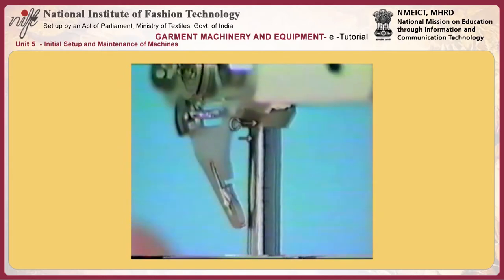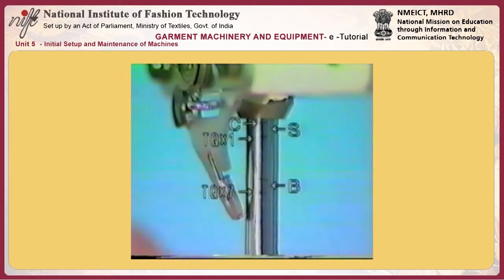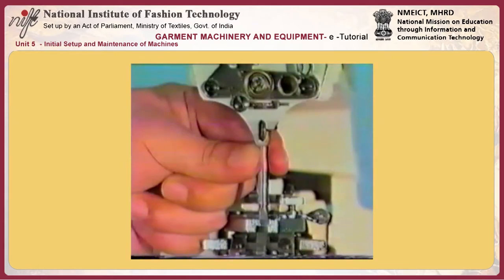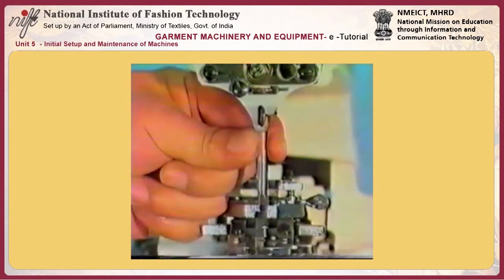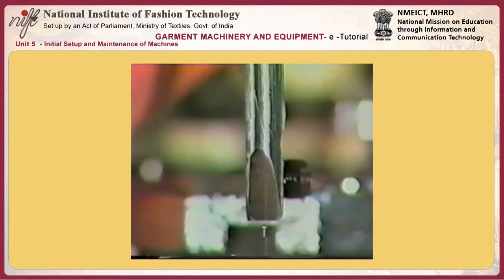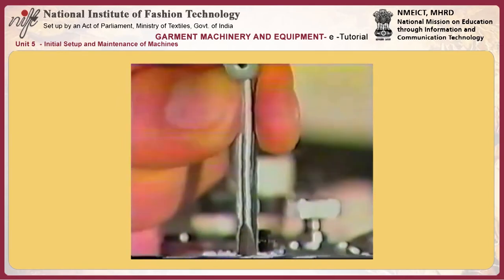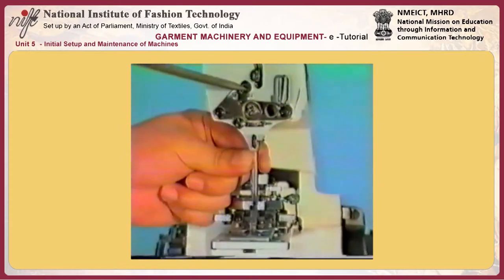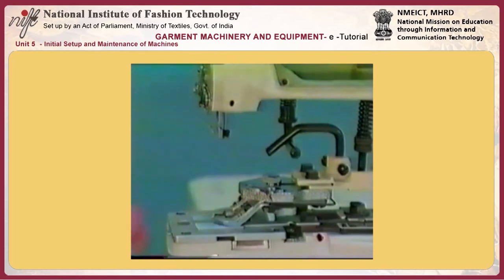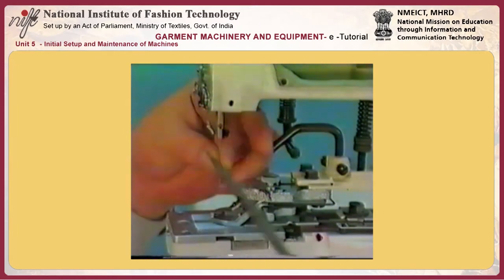When using a TQ by 1 needle, align the upper marker line of marker lines S on the needle bar with face C of the needle bar lower bushing. When using a TQ by 7 needle, align line B on the needle bar with it. Holding the needle bar so that its inclined plane faces towards you, tighten the needle bar connection screw. Now, attach the needle.